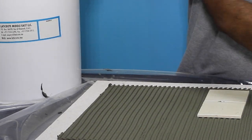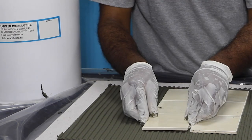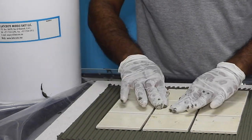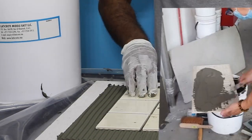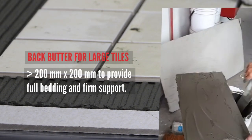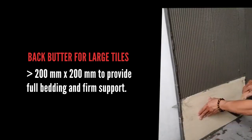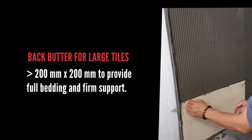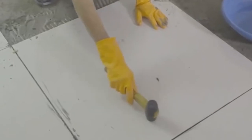When working with tiles, it's crucial to follow proper techniques for optimal results. Use a notched trowel of the appropriate size to ensure the tile is fully bedded. Spread an amount of adhesive that can be covered with tile within 15 to 20 minutes. For larger tiles measuring over 200 mm by 200 mm, it's recommended to back-butter them — applying adhesive to the back of the tile to ensure complete bedding and firm support. Place the tiles into the wet and sticky adhesive, then use a beating block and rubber mallet to embed the tile and adjust its level. This will help achieve a secure bond.